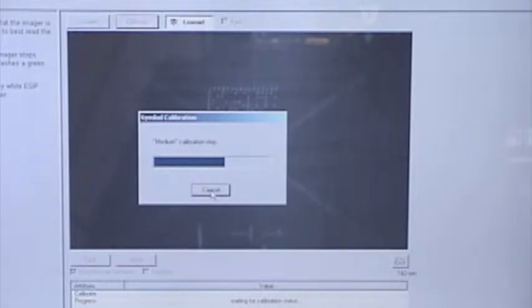With 2D barcodes, you typically want a darker image — not a super high contrast image all the time. I've found that a darker and even slightly blurry image works better. Blurring tends to make those cells more defined, especially with a pin stamp, because it's hard for the reader to determine where the locate bar is. Blurring creates more of a locate bar. Once calibration is done and the barcode is found, we hit Learn. The box turns green and it now understands the barcode — whether it's a 12x12 or 16x16 2D data matrix.